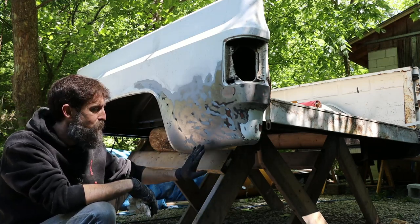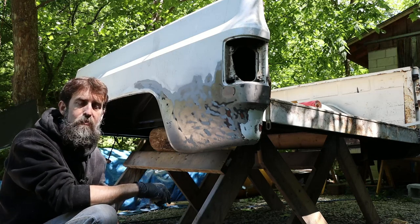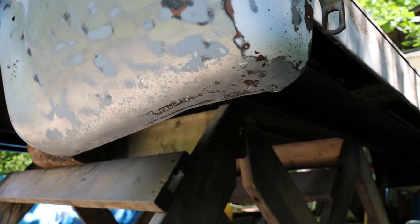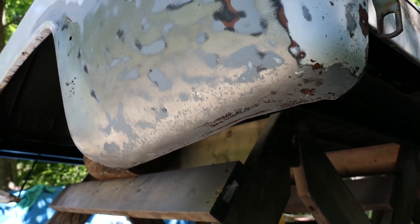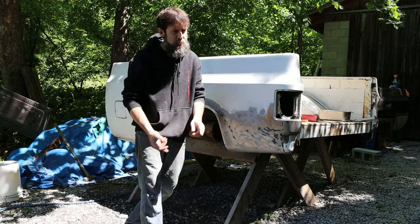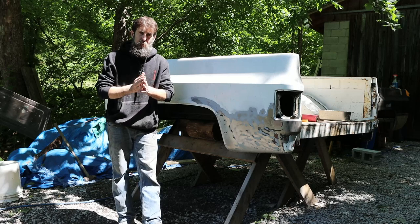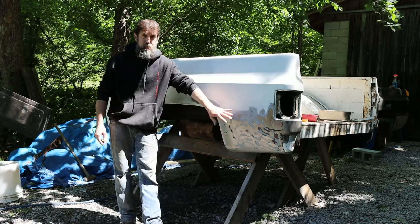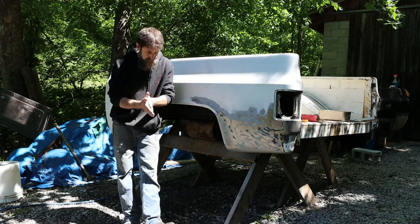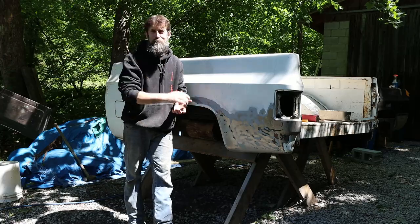Not at the bottoms of the little pits like you get when you just sand over the tops of stuff. You didn't remove a bunch of excess metal, you didn't create a bunch of heat. It is a great method, although it does have the drawback that you have to be very careful doing it. You've seen it with your own eyes — it removes rust like that. Not the safest method, but it is probably the cheapest and one of the best that I've seen personally. Know the risks involved, wear the proper gear — it can be done safely. You could spend two hours with sandpaper and still wouldn't get as good a job as that muriatic does; it gets to the bottom of every single rust pit. Thanks for watching — much appreciated, and I'll see you next time.